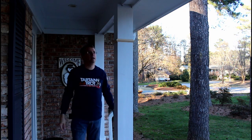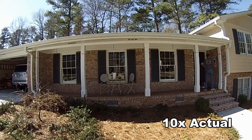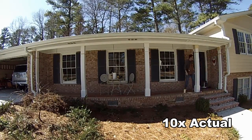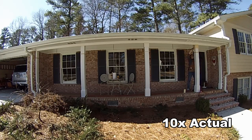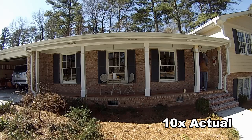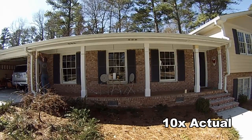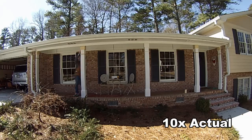And that's how that's done. Here I am putting up the tops of the columns, and since they slide around, you just have to clamp in place and put the fourth side on, glue it up, and then use the nail gun to nail them together. What you aren't seeing on this is the fact that I use a construction adhesive underneath before I put them up, and then I later come back and put the quarter round around just underneath.